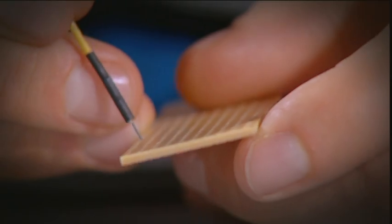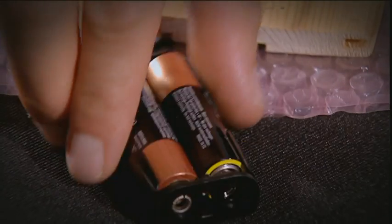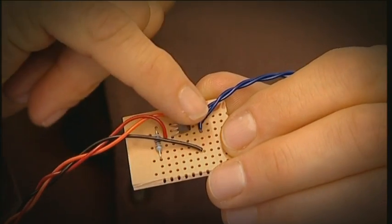That's got me thinking about how I could build my own DIY mind writer right here in The Gadget Show workshop. To make my mind writer, I'm going to use something I built in the first series of The Gadget Show — my £1 lie detector. This detects stress levels by measuring the conductivity of electricity in the skin. Here is the latest version: just a transistor and a resistor.